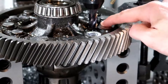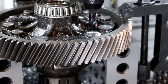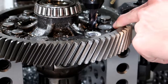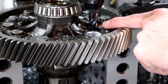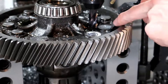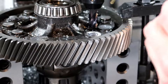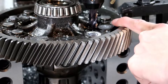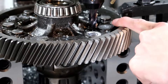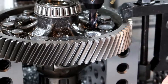On this one right here I stopped probably around five thousandths above this flat, and then I just want to manual it over and down. I want to leave like a thousandths between this flat right here and the rivet — whatever you want to call it. So I leave a thousandths there and it basically just picks up everything out on the side. I hope that's thin enough where I can just press this thing down through. I'm going to get a Harbor Freight press — hopefully 12 or 20 tons — and the bottle jack will do for now.